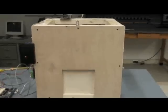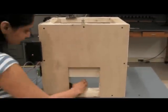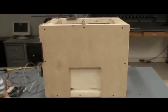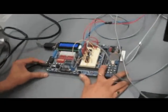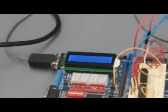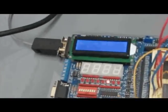The automatic security door opens and then closes the door when a correct code has been entered. An IR sensor in the door frame detects objects in the way and will stop the motor from turning. A correct code can be entered on the HEX keypad to open the door, and a personalized greeting is displayed on the LCD when the door opens. An RFID card can also be used instead of a manually entered code, with a personalized display, and the door opens and closes as normal.